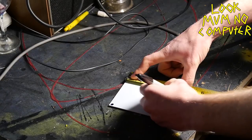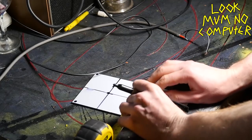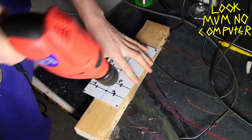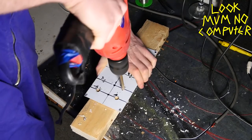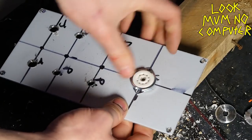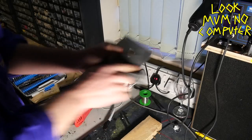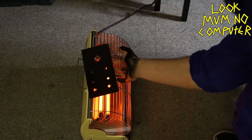To start with, we get the aluminium board — this one is 10 centimeters by 20 centimeters and it's two millimeters thick. I'm Sharpie-ing all of the dots of where I'm gonna drill, very precise. Then we get some pilot holes, really thin, maybe two millimeter, and then you get big drill bits specifically for whatever size your components are. This 22 millimeter one is for the valve socket, which there's a link on the website. Then you put it on, drill some pilot holes for the mounting screws, knock it out, take it all off, and give it a good sand so it gets all nice and rough so it can take the paint.